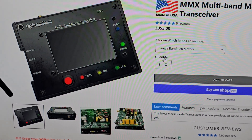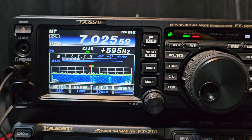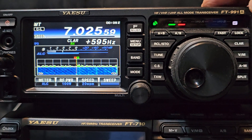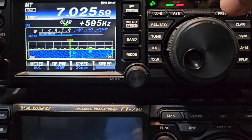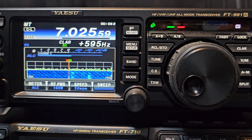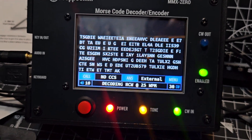At the moment I've quickly connected it to my 991A. For receive, all I've done is turned on the clarifier, tuned in to a station — not even a very strong one — then pressed the clarifier and gone up plus 595 Hertz until it started decoding. That's all I've done.